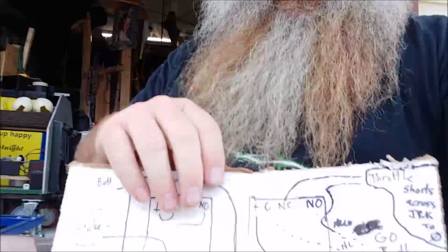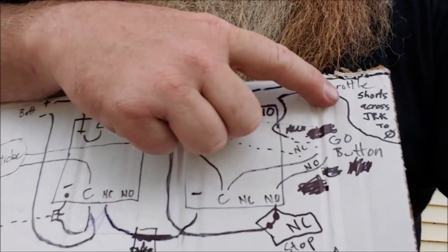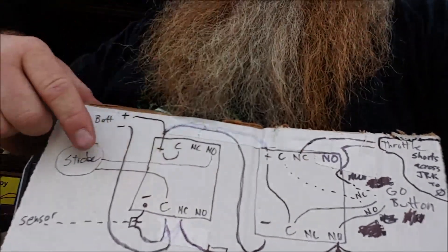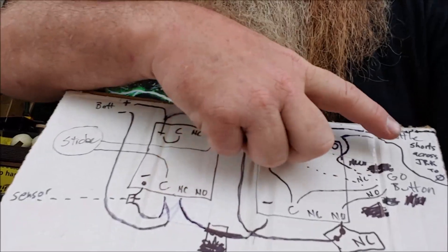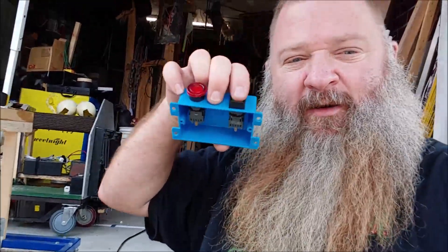When this relay is not powered it's shorting normally closed to common, which is wired on the controller to short across the pins of the potentiometer, and it reads zero — telling the speed control the potentiometer is all the way down. When you push the go button it opens that up, allowing the throttle to return to its normal speed state. This is important because if this board doesn't supply power, the cart can only be driven by the physical green button on the back of the cart. We don't want the cart to start up without being supervised on the track, but if there are people on it and we want to move it we can reach down and manually adjust the wheels.